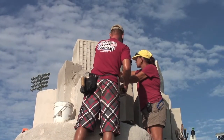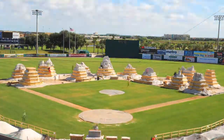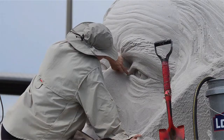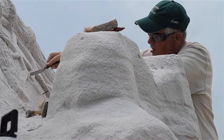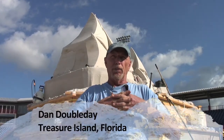You go to the beach — our beautiful beaches here in Florida — and the sand has been rolling around in the ocean like a big rock tumbler. You pick up the sand, stick it under a microscope, and the grains are round like a marble. If you try to stack marbles on top of each other they slide off. Sand from a quarry, river, or lake is going to be angular, flat, with some edges — it holds itself together and binds really well.